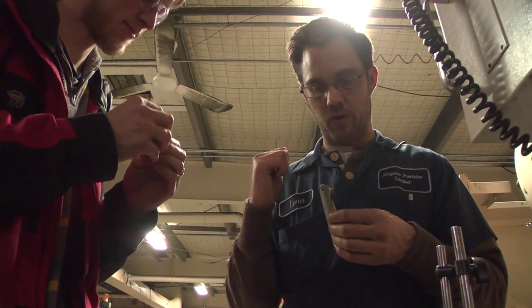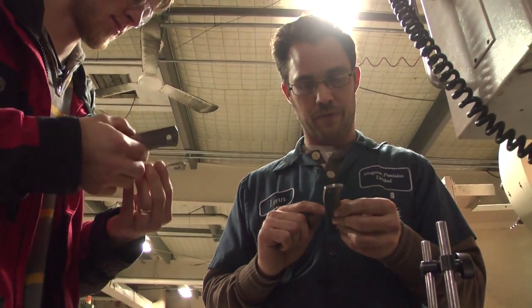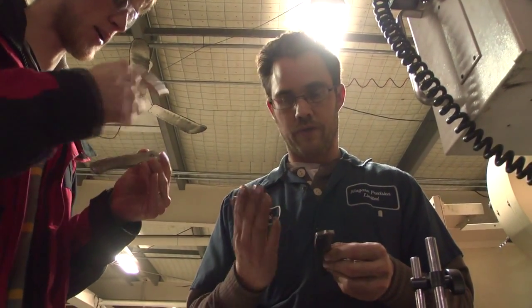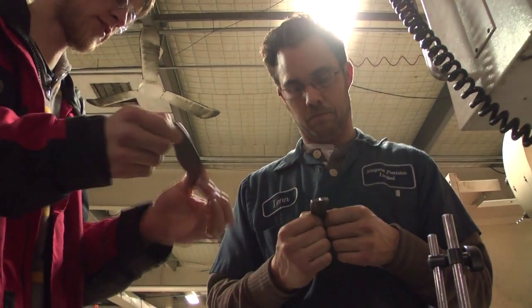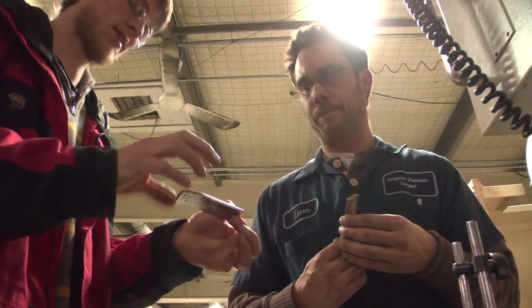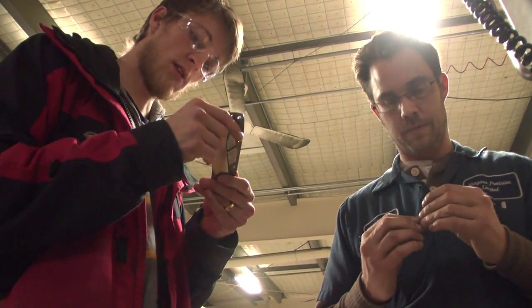There was, according to the CAD model, a discrepancy of 3 thou between the pitch of these two holes. Oh, yeah? From one side to the other. But you hold them up, they line up pretty good. Okay. Well, these two get bolted through with a pivot, and this is just a lanyard bolt. So they don't line up. But that's interesting that they're a little bit off. I'll have to look into that.